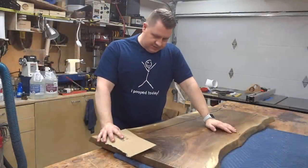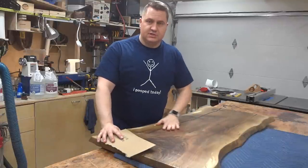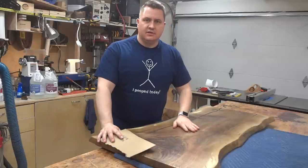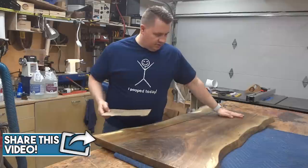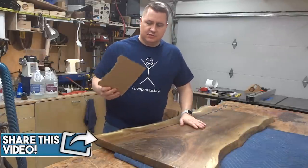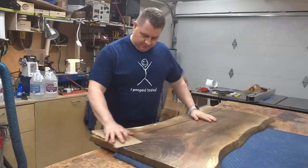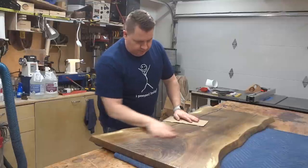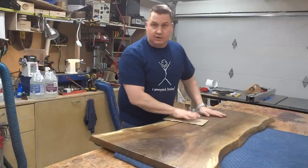This is one of my last finishing steps. After I've done two or three coats of Armor Seal finish, I let it dry for several days — this has been sitting for over a week — and then I come back and burnish it with just a piece of cardboard. I'm feeling it right now and I feel some nubs; I could knock those down with sandpaper, but this works pretty well. You can immediately tell it's knocking those down without causing any sanding scratch lines — it's amazingly smooth.